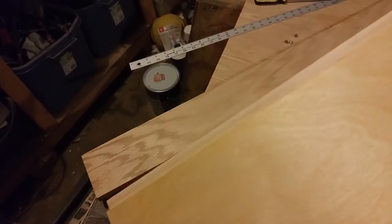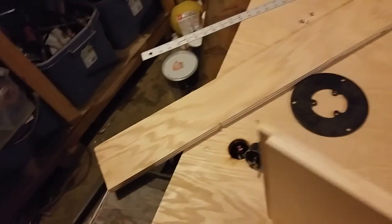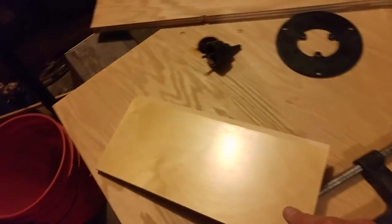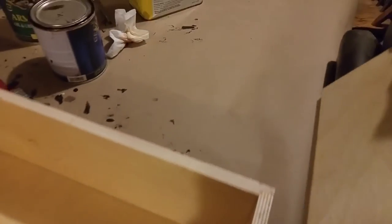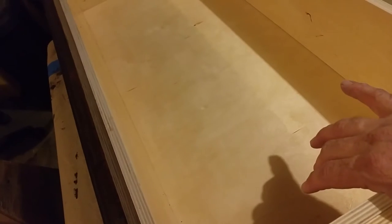It's nice wood — it has a nice finish on it, nice and shiny, and has a lot of plies. You can get this in a five by five sheet and a full sheet. I used the five by five sheet and had quite a bit left over. So there's really no reason to use something else for the bottom — that's why the bottom has a full half inch router dado all around. Basically that board goes down like this and the bottom fits into it, giving it a lot of structural strength.